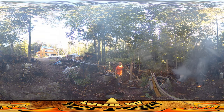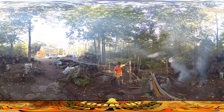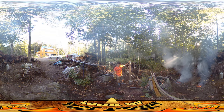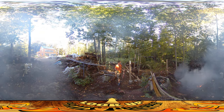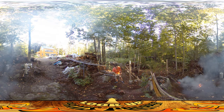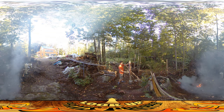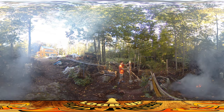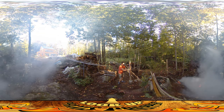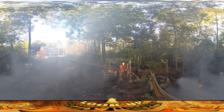They've actually been burning pretty well. What I wanted to talk about today is I'm putting in the last corner here — the fourth corner post — and these are going pretty well. I might be able to drop this guy in; I'm not sure, it's getting a little bit late. I just want to talk about how I get these guys vertical. The way I do that is I'm using a level, getting this guy as plumb as I can, and I've got these sticks on the side that I can screw it to. I'm just going to roughly line this thing up with the level right here.